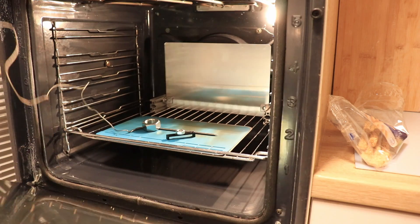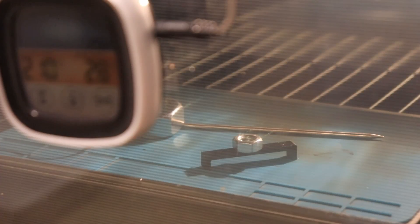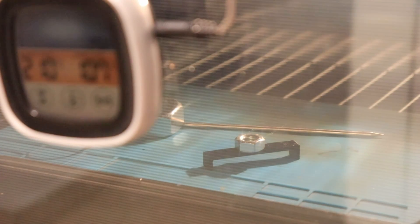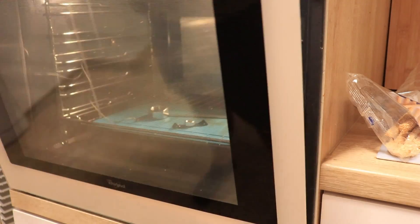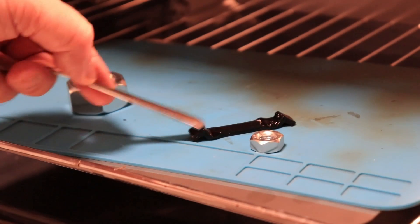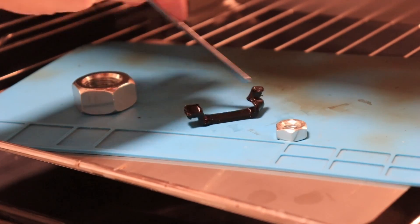This is the temperature test in the oven with an M10 nut as a small load. I want to record the temperature of the first deformation and I'm following the temperature with a cooking thermometer. This is a time-lapse speedup of approximately 15 minutes — nothing happened until almost 180 degrees Celsius when I noticed the first deformations on this test object. It starts deforming very suddenly, so I stopped the experiment at 200 degrees Celsius. The object completely deformed and was very soft after this test.